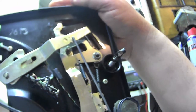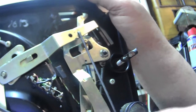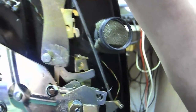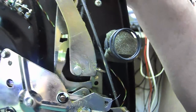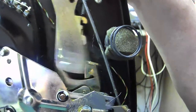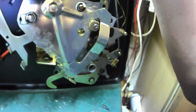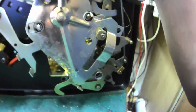So when you move the lever, you see this here? That drops. And that part is not in the Autoslim. And it's that part there that does the same job as the control arm. It goes to that bit of a linkage down there, which then goes and operates that linkage you can see near the bottom there. And that's how it works on the SP25.